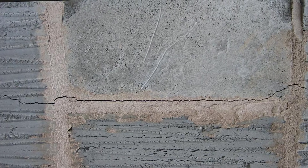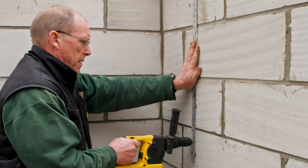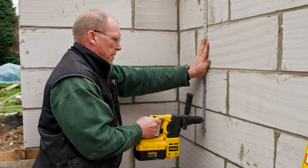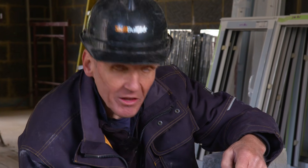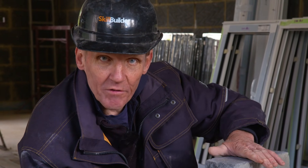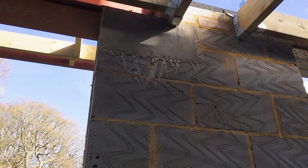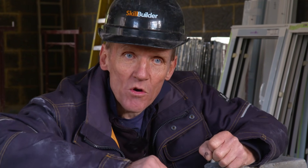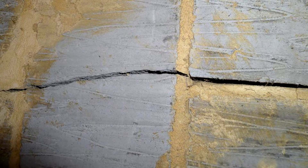This is a video about cracking in buildings, more specifically cracking with aircrete blocks, because you see this all over the place. These are a very popular building material because, as the name suggests, they're full of air, which makes them a great insulator — you get an incredible thermal resistance. But they're not that strong; you can actually break one quite easily, snap it in half. Having said that, they will take a crush load or a point load equivalent to about the weight of a JCB, provided they've got a concrete padstone on top. You can put steel beams on top of them. But as the building starts to move, dries out, the blocks shrink, or the building warms up and moves in and out as all buildings do, you find that these blocks start to crack.